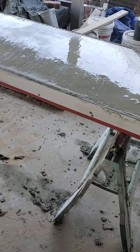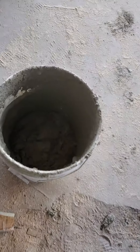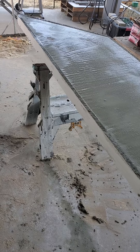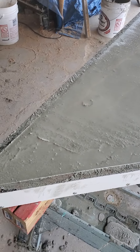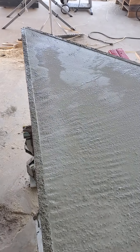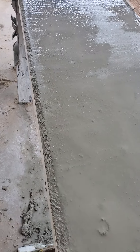It's a little bit of a mystery where the extra half cubic foot of material went — but you can see there's a lot of overspill and I've got half a bucket of mud left too. It's just a little bit of mixing, scraping stuff out of the bucket, and not getting a full batch. I'm glad I cracked one more bag because it was just under the edge and I really wanted a two-inch edge. You can see the wet surface is already starting to show signs of curing — it's only been about five to ten minutes since we stopped working it, so it sets pretty quick.